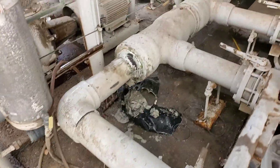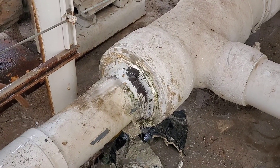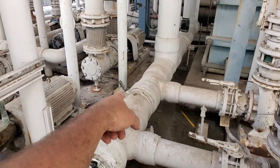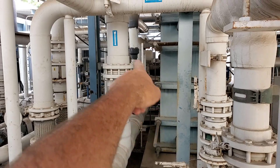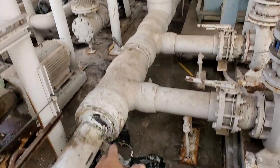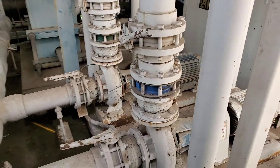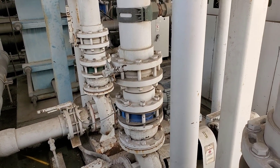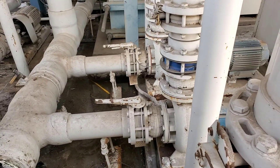This is going to be the way it runs for a while. Got that leak coming out right there — that's only 4 to 5 psi. We put a gauge right there to measure it: 4 to 5 psi comes after the heat exchanger, which is plugged. Almost 30 psi goes into the heat exchanger from the tower pump, dropping to 4 to 5 psi, coming over here feeding into that pump. I have to choke off the discharge almost to 80% to keep it from cavitating. That pump's probably not going to be happy loaded up with the valve throttled like that, and it also has a lot less volume of water.